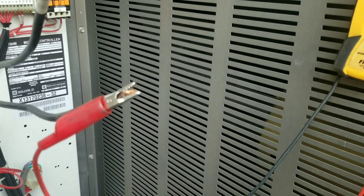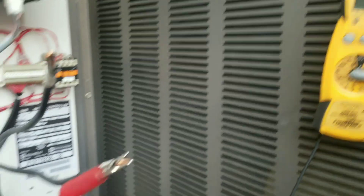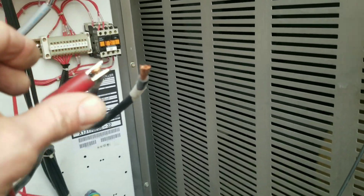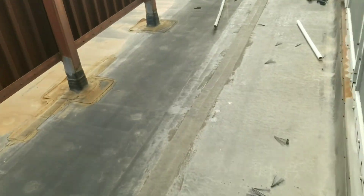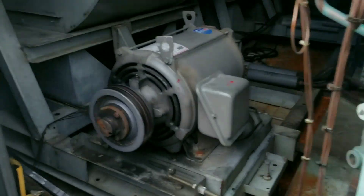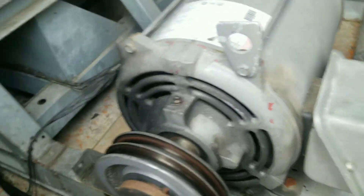Let's get this cover off and see what's going on here. We're just going to home in on this motor issue. This VFD is in alarm and I can't get it to reset. It didn't go on a power reset and I don't see any manual reset. Reading 2.3 and 2.3 and 2 - motor seems to be okay, even though the bearings are a little noisy. I don't see anything majorly wrong with the motor.